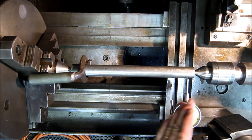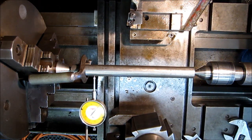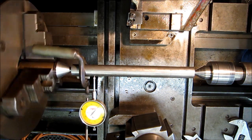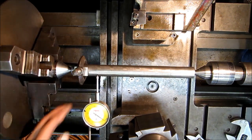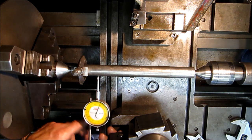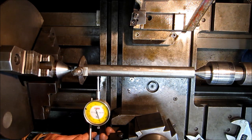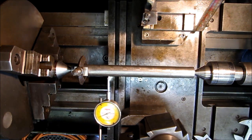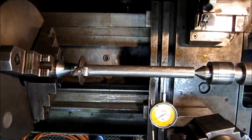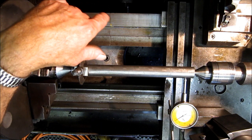We're going to set zero, and we're just going to check our travel this way here, and we want to see how it fares. Okay, we got like plus three there. Let's 180 this. Okay, we're going to 180 this — we have three plus here. Okay, even 180-ing it, we're back to three minus, so we're heavy over here.